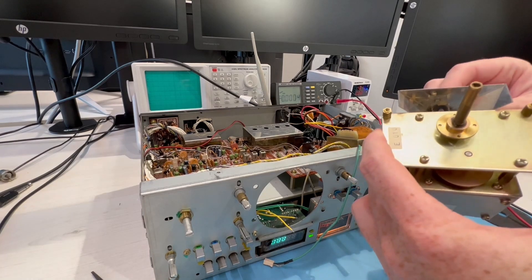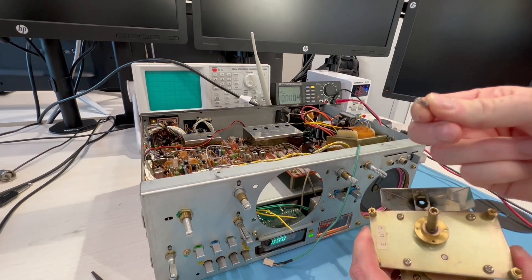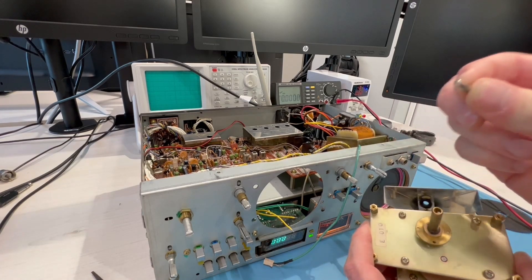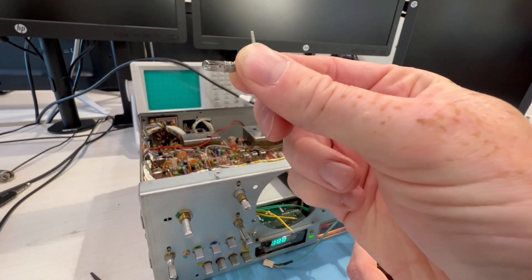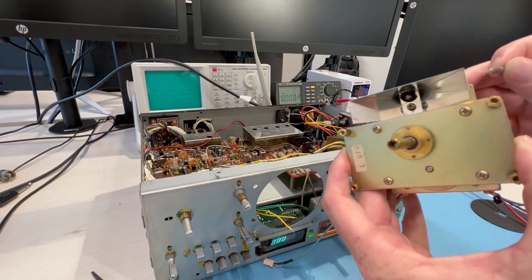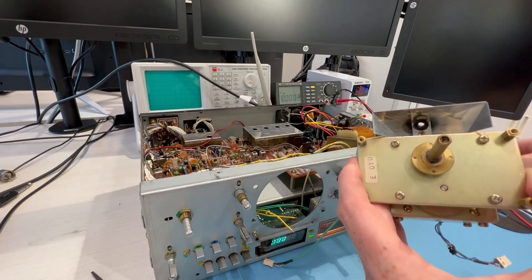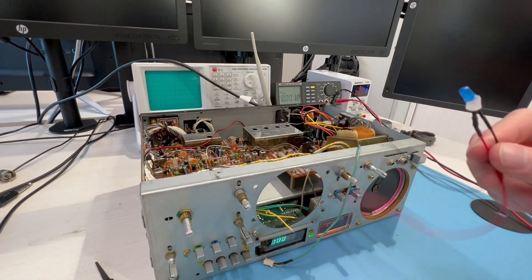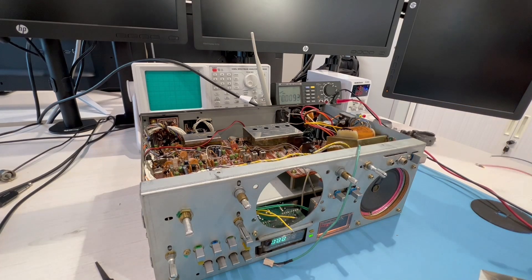I have the VFO out now. This is the blown bulb — it looks like something from a train set. It's about 12 volts, maybe 9 volts. That's the bulb. It sits inside the VFO, so we need to change it. I don't have that bulb right now, so I'm going to try putting an LED in there — let's try a blue one, simply because I have one.